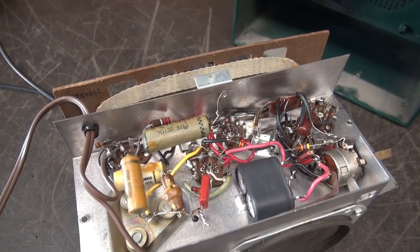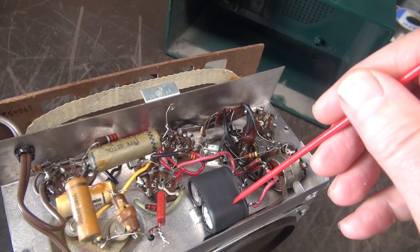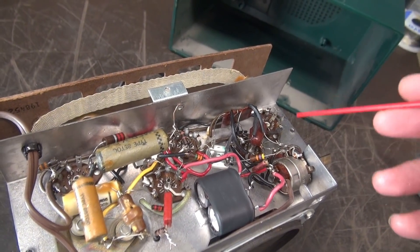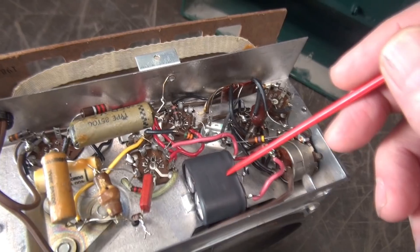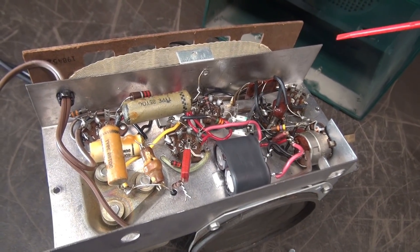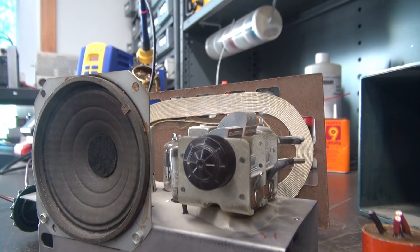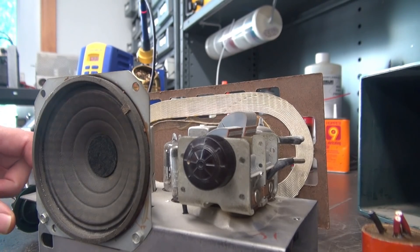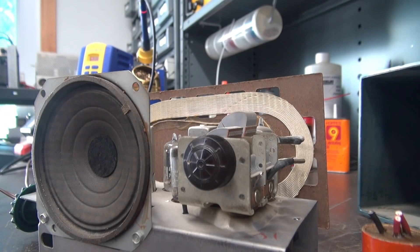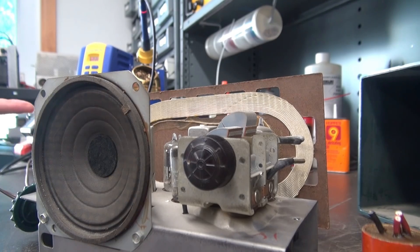The new filter caps had to be laid down and glued to the chassis — the clip wouldn't hold them correctly going vertical and they would have interfered with the shielded cover. I went ahead and glued her down and got her all soldered up. Put some insulated plastic knobs on, since it is a hot chassis. Be very cautious when working on these — there is no transformer, so if you touch that chassis and touch the ground on your test bench you're going to get poked with about 150 volts. Volume is down, no hum — got some white noise.